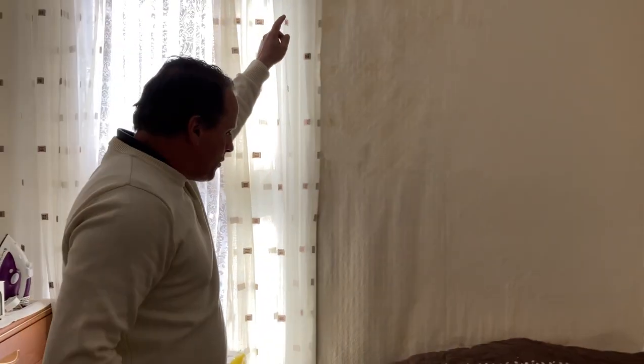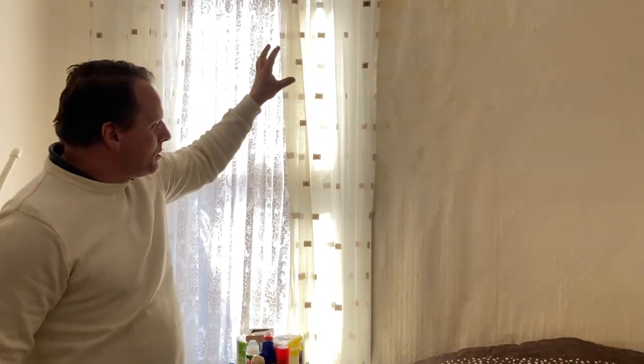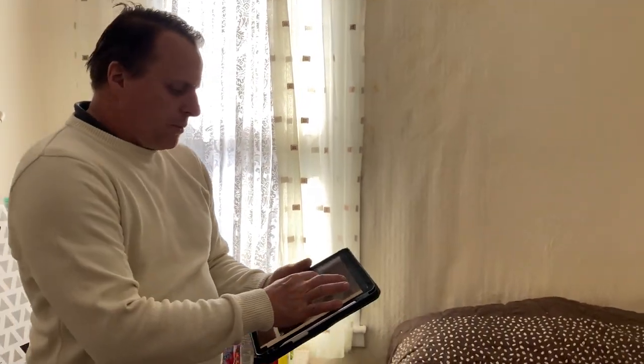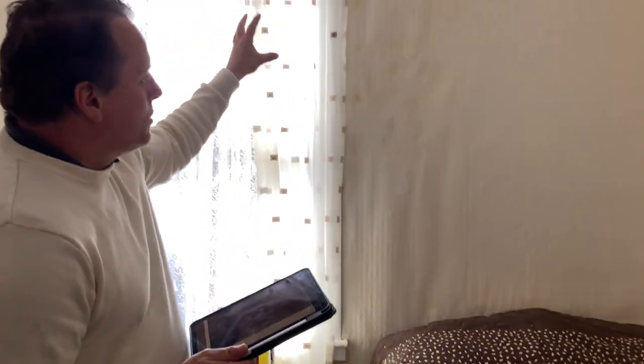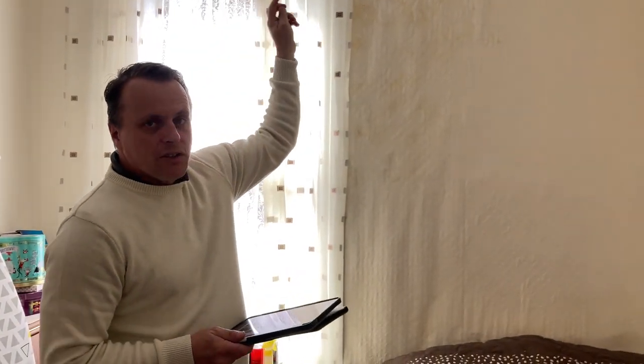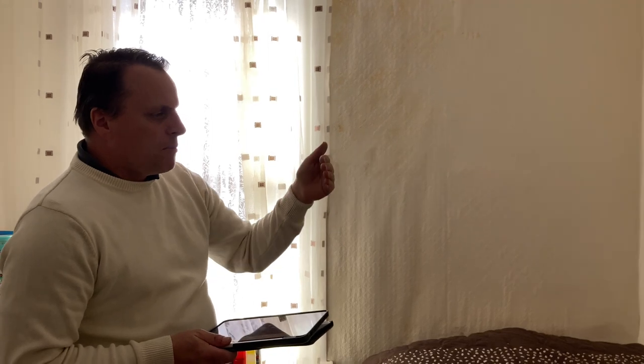In this same room on the rear wall we've got some damp staining, and in the bedroom upstairs there are also some issues. Our photos show a whole array of damp meter readings. This seems to be rainwater from the main roof discharging onto the rear addition roof, and because the soil stack is tucked in that corner there's a quirky weathering detail around it. Overspill from that gutter during heavy rainfall is coming down through one rainwater pipe, causing this wall to be slightly damp — it's actually quite easy to sort out.